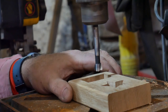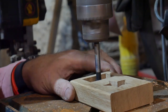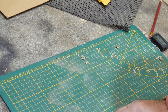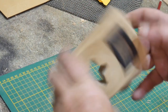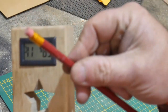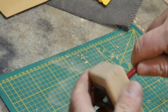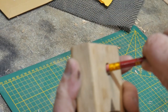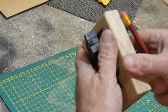So why are we back at the drill? Well, the thermometer needs to have air circulating around it. So I put a hole all the way through - that little point on the other side allows me to drill from the other side. Oh, have I put that the wrong way around? I think I have! But there's another reason why that hole's there - you can use a pencil to push the thermometer out. And it'll pop right out. There it is!